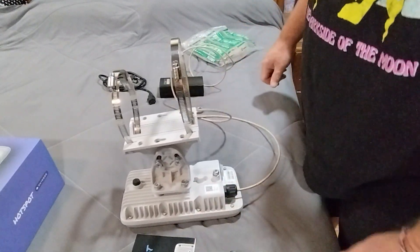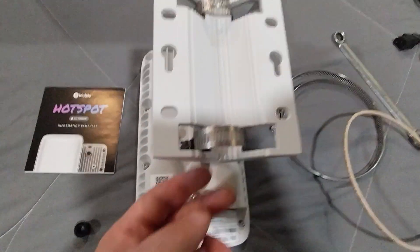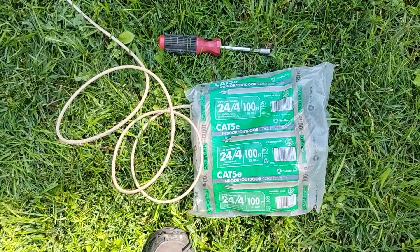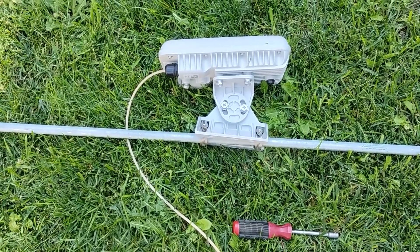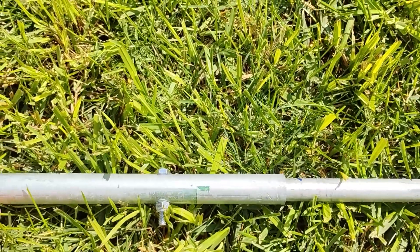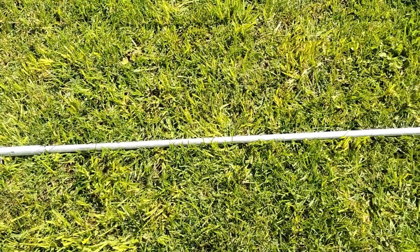For my installation I'm using half-inch EMT tubing, so the included hose clamps are too big, but heavy-duty automotive hose clamps fit great. If you've drained your piggy bank buying the hotspot and outdoor Cat5, masts can be expensive. My workaround: a piece of half-inch EMT from Home Depot for about $6, and a three-quarter-inch EMT for about $9. Together that gives me a mast of about 18 feet tall — I drilled holes through and bolted them together. For less than $20 I've got an 18-foot mast. We'll find out today if it holds the weight.